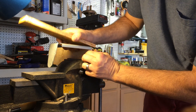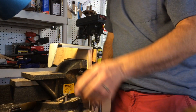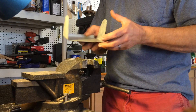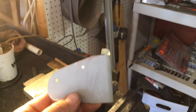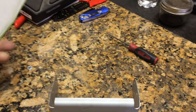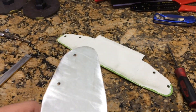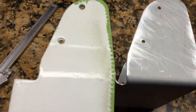Here I have some footage from the actual shroud and its bending process. Right there you can see me releasing it — I had to raise it up a little bit so that when I bent it over, the ear from one side wouldn't hit the anvil portion of the vise. Right here I'm just comparing the size difference. There's the template I made out of the original piece, and here is the difference between the two pieces.